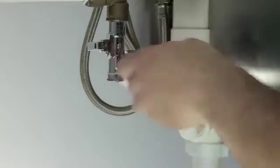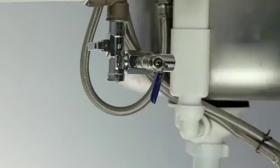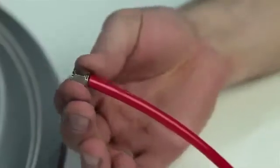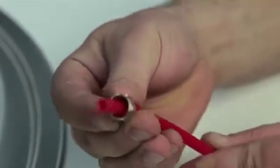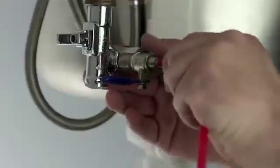This connection fits the most common pipe size of a half inch. If your pipe is 3/8 inch, use the adapters that come with the filter. Put the 3/8 inch adapter on both ends of the feed water adapter and then screw the adapter into the cold water supply.